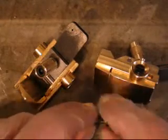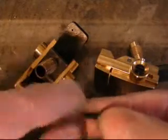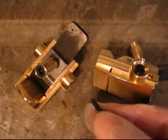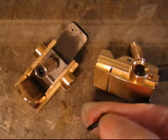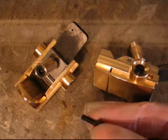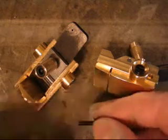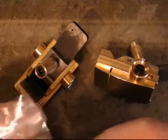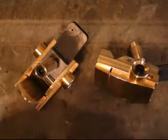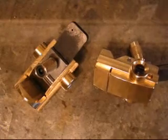Just as with the drilled holes, what marks these as clever is that the threads are a very good fit into the body. I learnt that quite early on when I got the ornamental lathe just after I turned 18 — the quality of fit and finish, particularly the threads, was utterly incredible, especially for something at £18.95. So from then on, it's important that when you make a screwed part, it is a good fit. Not a fit that needs to be driven in or abused to get it to work, but something that functions smoothly but close. Minimum slop — then you have a stronger thread.